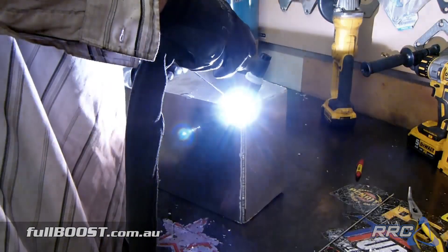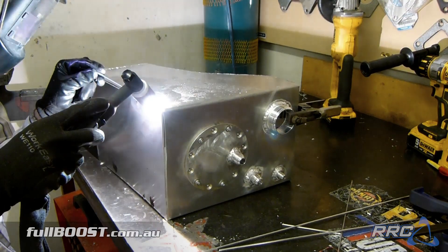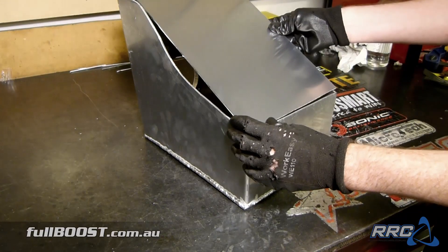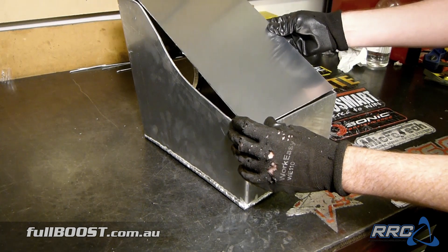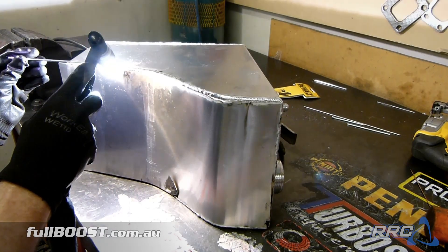With all that sorted and the carrier complete, it's time to seal up this fuel cell. It's just a case of fitting this to here — generally we start with a couple of tack welds down here and then it's just a process of forming this into place along the way. That looks like a lot of hot work even from behind the camera. Well, hats off to the boilermakers who had to do this for a day job in hard, hot, windy conditions — that was honestly a terrible job. I'm glad it's done and finished. It's time to put that in the pile that's growing with other stuff that needs to go to the powder coaters, and we can move on to the next job.